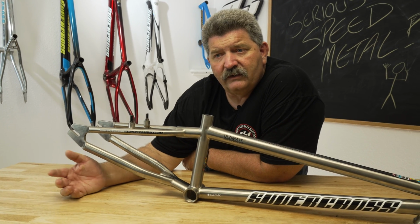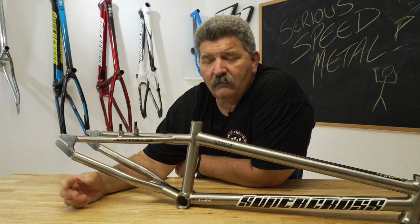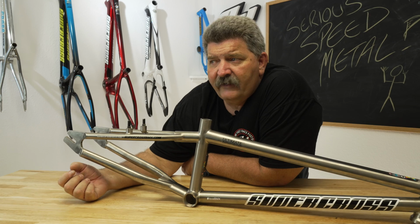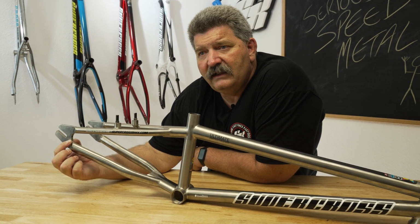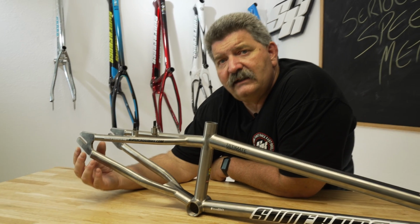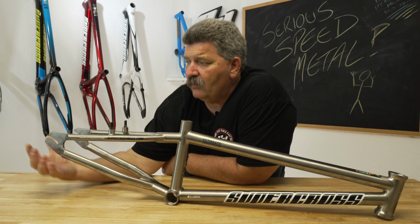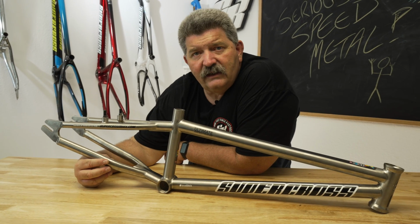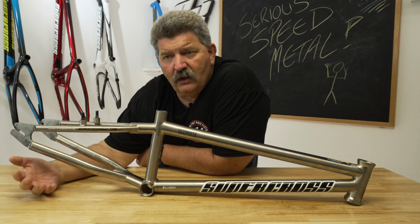Race car motors, they know, don't use titanium bolts in head components. Don't use it in the bearing components because it's gonna stretch. And the problem with the titanium is that it does have an elasticity to it that allows it to stretch. And that's fine. It's got a great yield. It's got a great memory to where it's gonna flex, it's gonna stretch, it's gonna come back to it. So it is really light, and you can build a super light structure with it.